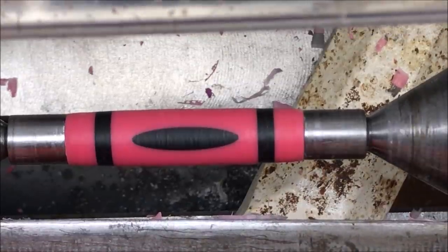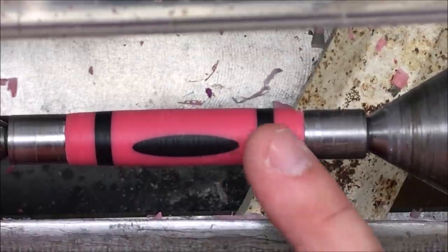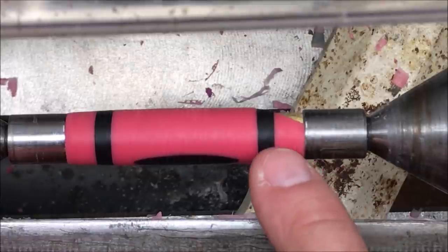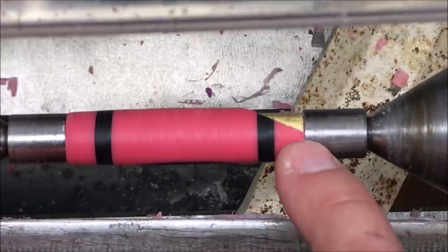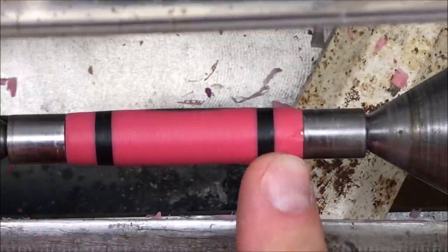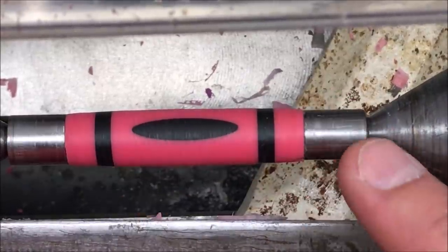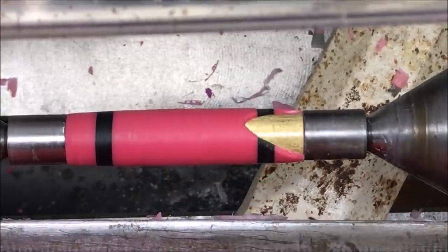You saw it live and in slow motion. Famous last words — one last pass. At some point that's going to be on a t-shirt for RJB Woodturner. You can see right here there's a couple little skip marks. As I came across from the bushing to the blank and made contact, I skipped — looks like four or five skips there. I caught and ripped this little section off, and then re-hit the blank right there, putting a chip there. I didn't feel any vibration when I put my parting tool on there, but for some reason I was just chattering against the blank, and that caused that.